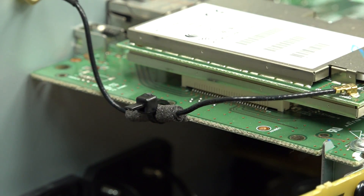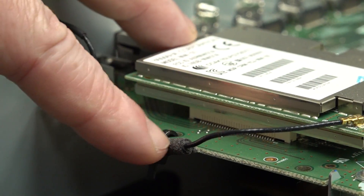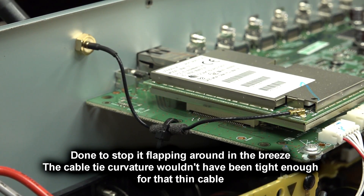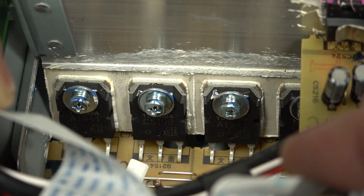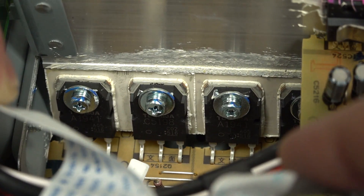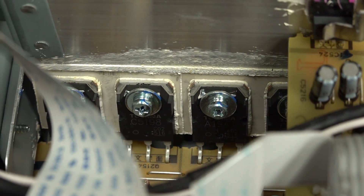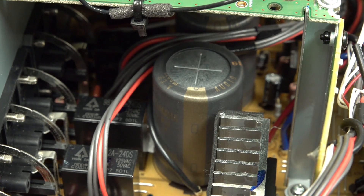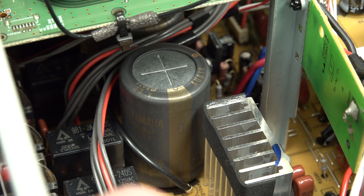Neat attention to detail - they've got the Wi-Fi antenna cable tied in there, and they've added a little roll of foam to protect the wire. Nice. I was curious to see the power transistors down there - none of this integrated circuit rubbish. They've got discrete transistors for all the channels. Everything looks in great nick. The heatsinks are on an angle, which is really kind of funky. The main power filter caps - there are two of them - look in great condition. They're actually Yamaha branded, probably rebadged Nippon Chemicon. Audio-grade electrolytic main caps.